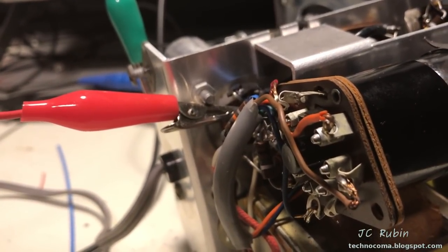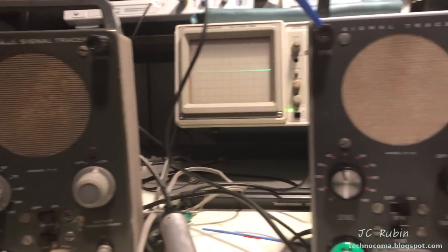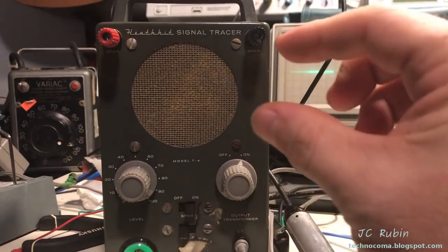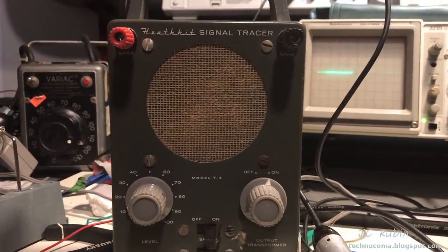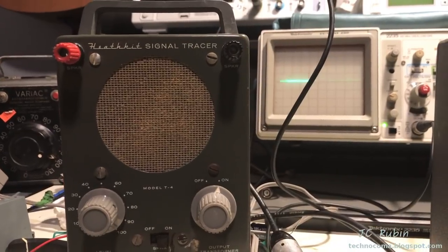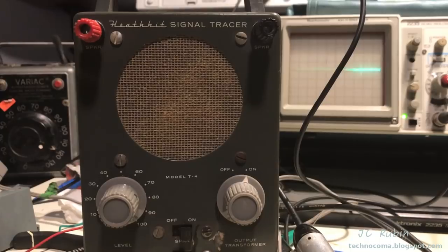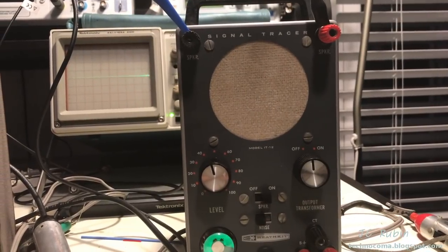That never gets old. Finally, to satisfy my curiosity, I've measured the white noise of both of these units side by side. I find that the older one is slightly, marginally quieter. On the oscilloscope, it is like 2 tiny graticules smaller on the 10 millivolt scale. They make the same amount of residual background hum. Here is the left one. Here is the right one.